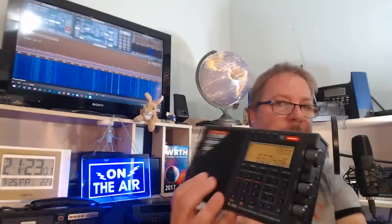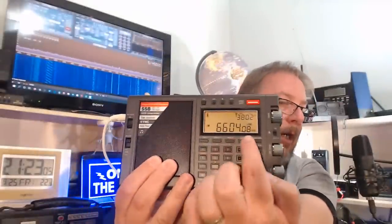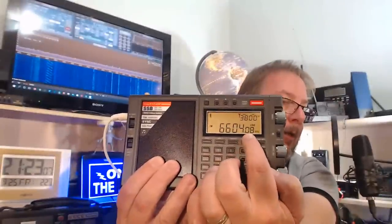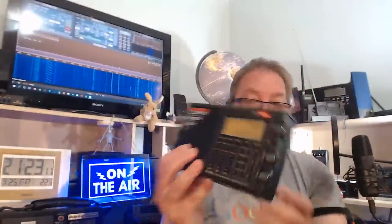Kind of nice. Let's check out Gander Radio. 0 degrees, 6 knots. So this is Gander Radio, Newfoundland, Canada weather. 6604. So you see, I told you I was off by 80 hertz. So I'm at 08, but it's always correct. So when I'm at 08, I'm at pretty much zero beat for single sideband.